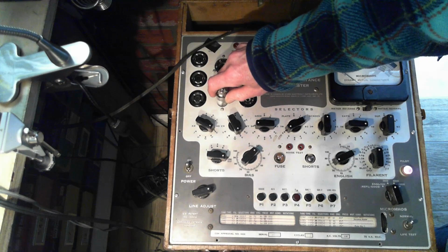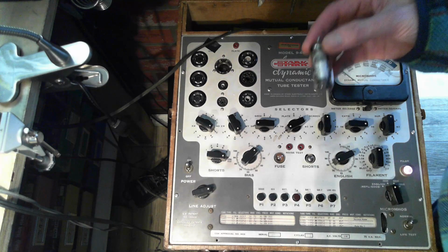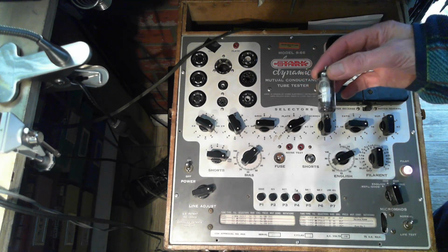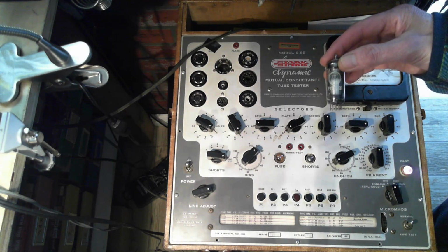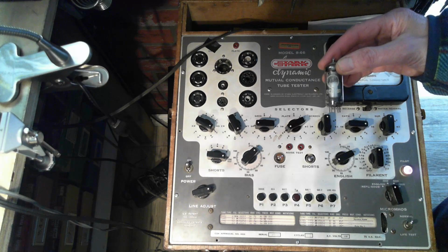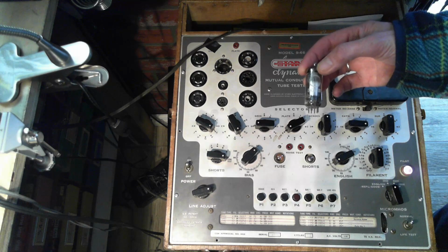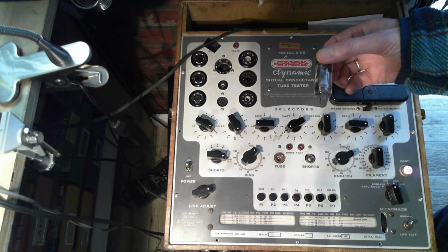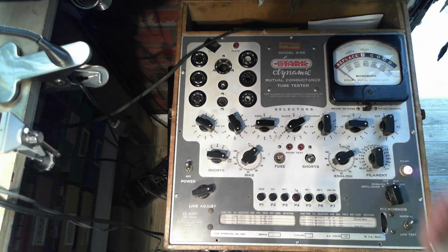This is probably the reason why the radio is so dead. Because this thing is so dead. You gotta wonder, how does a tube like this get this dead? Surely to goodness, before it was this worn out, the radio had stopped working. What, did somebody just leave it on for a few more months to see what would happen? Or some grosser failure, like gas getting into it, or air getting into it. Yeah, this is probably the heart of the matter right there on that tube.